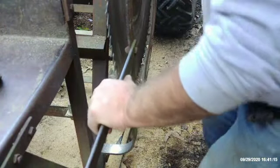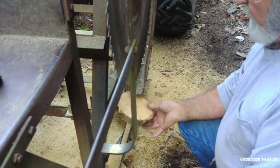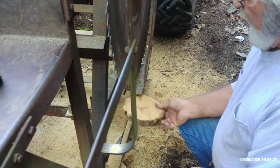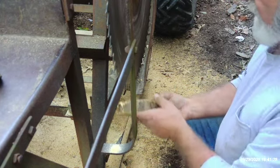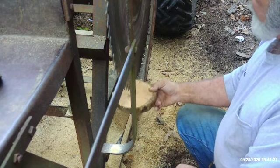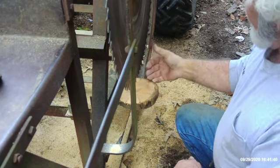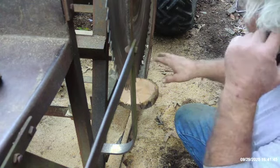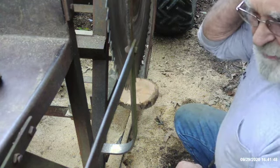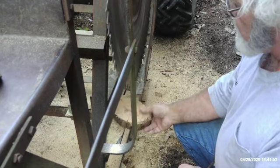Very, very important. As I'm stacking those cuts, I had to be very gentle. I didn't want to dislodge this, but I wanted to show you this little round offcut that just lodged right there and is resting. It was kind of propped up with some wood, but it just caught perfectly in there. Had that bounced and come in contact right here, it would have been immediately drawn up into the blade. The blade would have cut into it. It would have stalled the blade and the arbor, I'm sure, because it would have hit with such force, it would have just jerked it right in there, and it probably would have jumped my belt off. So that's a very good thing that it actually lodged and stayed right here on the side.